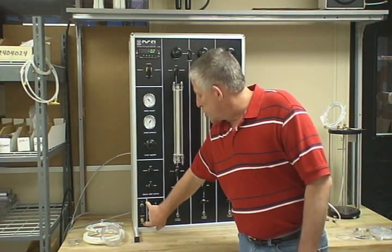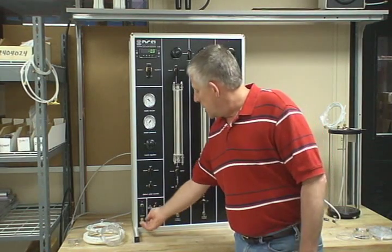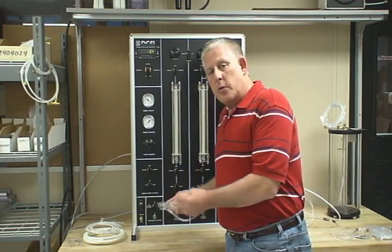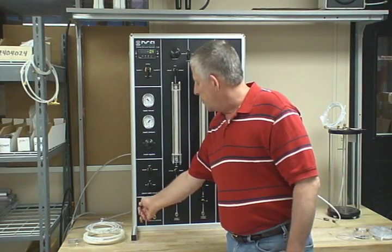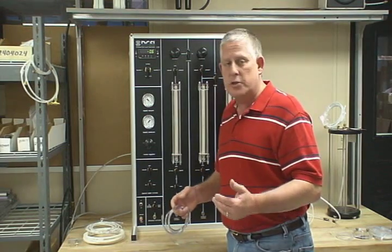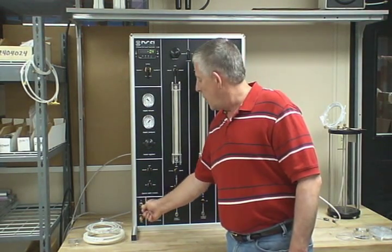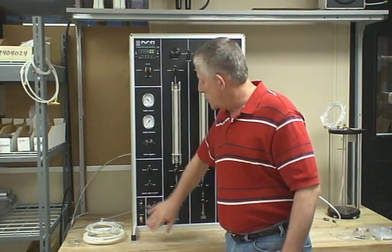This valve here is used for your membrane stretcher. You connect quarter-inch OD tubing, attach the other end to your membrane stretcher, and turn the vacuum on. Be cautious with this because if you turn it all the way on, you will get 30 inches of vacuum — or almost 30 inches — which may rupture your membrane. So what I normally do is just give it a little bit of vacuum, off and on, until you get the membrane stretched out into the membrane stretcher. Once that's done, you can shut this off and you won't need any more vacuum.